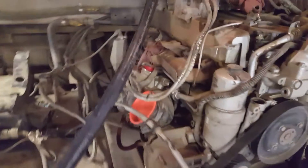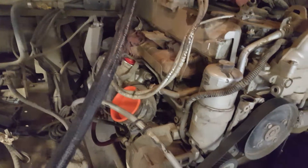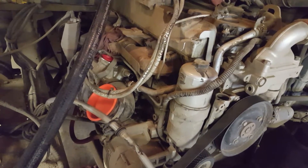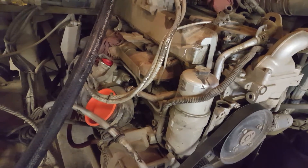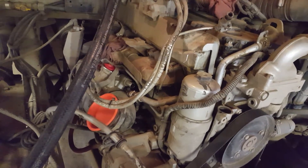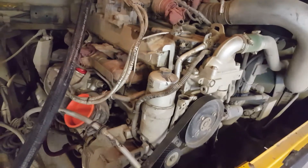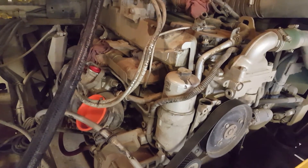Just something to look for — you really had to look because it just had a couple of cracks, but over time it's going to wear out. It's definitely not good for the compressor; the grit and debris getting into the intake system causes wear and tear. If you have these models — HDX Thomas pusher — definitely check out that intake piping.